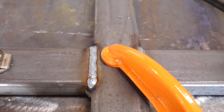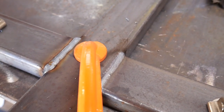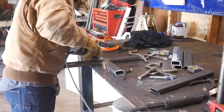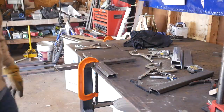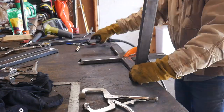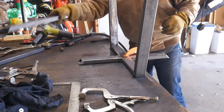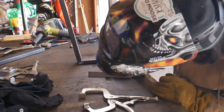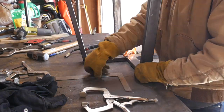Here's a sneak peek at the welds — unfortunately these will be ground off because I'm going for a nice smooth clean look. I'll grind these off then do the same on the bottom, running flap discs — these are Benchmark Abrasives, I'll have a link in the description. Now that the bottom part of the base is done, I tacked everything together to get the basic shape and checked for square. I actually had one tack pull way more than expected, so I broke one off and had to re-clean the joint.